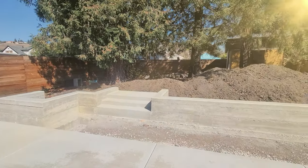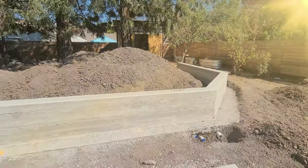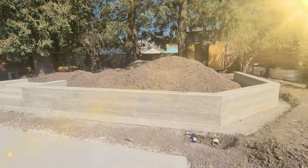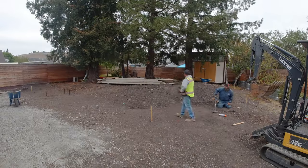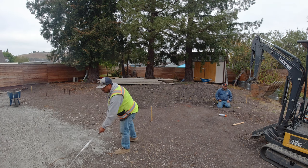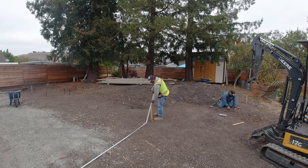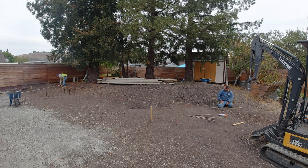As you can see, we're putting that drone to use throughout this video — we're going to have some drone shots and drone pictures, so definitely stick around. This retaining wall is approximately 65 to 70 feet long, two and a half feet tall, and 10 inches thick as opposed to eight inches. Our footing here was about 32 inches wide, averaging about 15 inches in thickness — ideally we go 18 inches — with number five rebar, 12 inches on center. That's pretty much our standard setup for anything two feet and above unless plans call for something different.